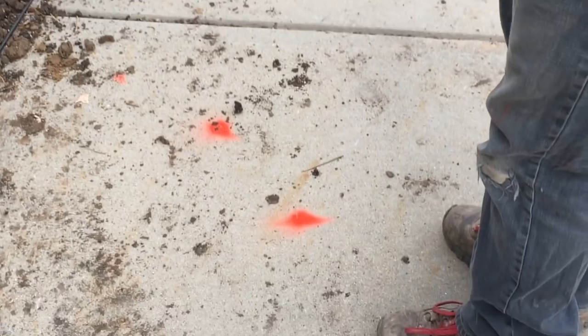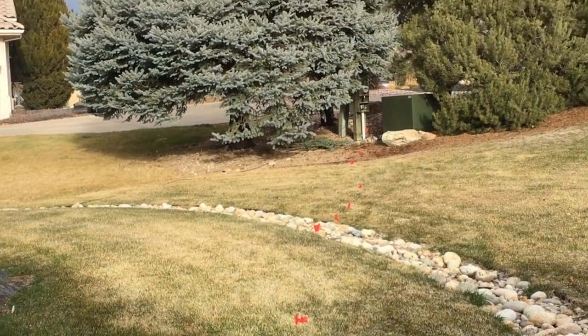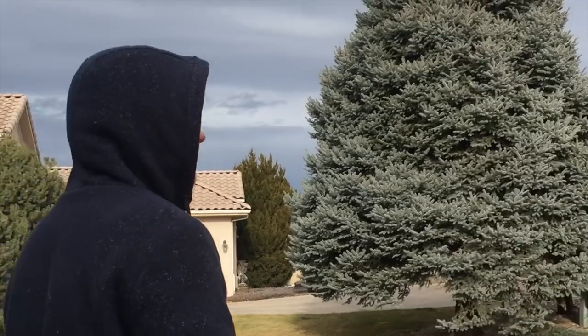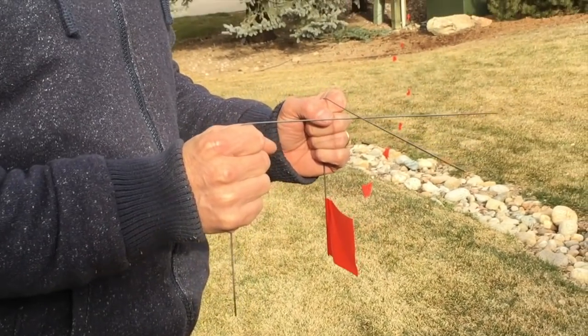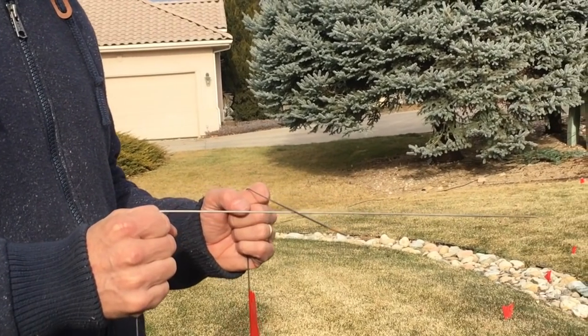I'm right on top of it. Common sense says it comes from there because I measured off the side of the meter, came down, and put a flag. I drew a straight line. Most electricians are really cheap — you don't want to run a big S-curve with wire. Now, the part that can be bad is that you can pick up cold water pipes underground, especially if they're copper. You can pick up a gas line, sometimes even sprinkler wires and sprinkler pipe. That's why I really focus on three or four different methods to make sure I know where those wires go.